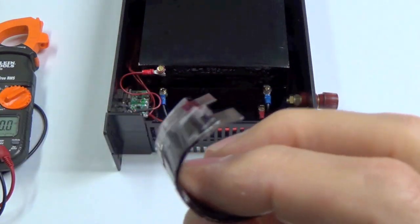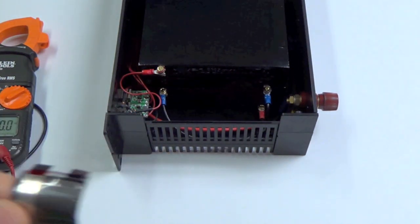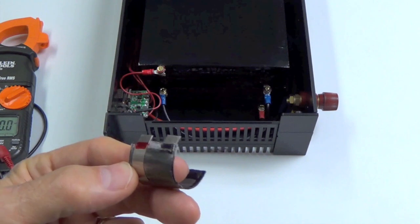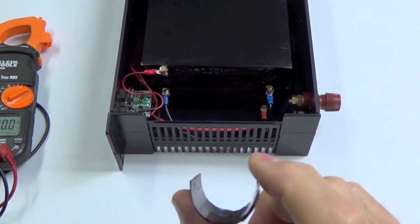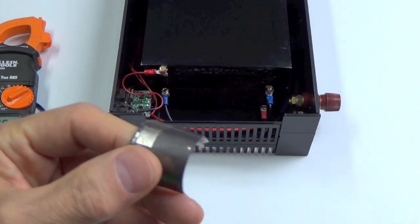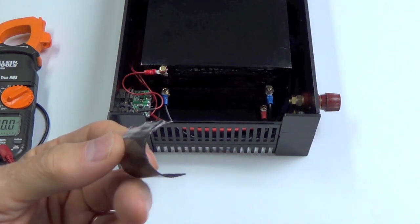When I first made this thing, it pretty much read zero volts at zero amps — it was less than micro amps. So I immediately chucked it in the trash and said, okay, that was a failed experiment, try again later. But I slept on it that night, came out the next day, grabbed it out of the trash, and thought: sometimes these have to be compressed or deformed to actually get it into a working condition when it's a solid. So what I did is I took a broom handle — it's really crude — and I just wrapped it around the broom handle, and suddenly the thing just came alive. It was like 1.5 volts, still is, but low current — I think this one's between 50 and 100 micro amps. So not a lot of current, but decent voltage. What was a failed experiment turned out to be very interesting.